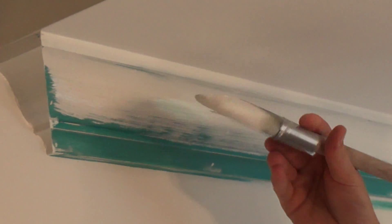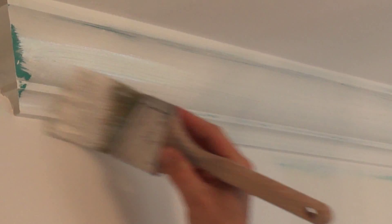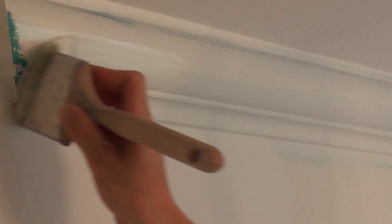I'm going to add some more paint here. Once I have that, I load up again, turn the brush around, and overlap right onto the wall. That's going to get the paint to cover the caulk line, and then I just come across down.